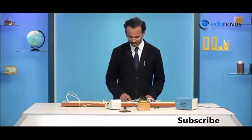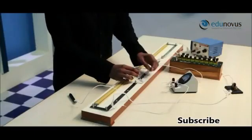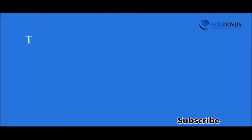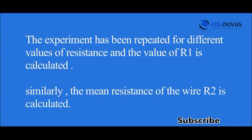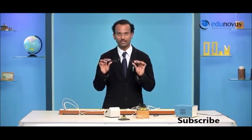Similarly, you can find the mean resistance of the second wire R2 by replacing R1 with R2 in the right gap of the meter bridge. When we connect the two wires end to end, they are connected in series. To find the effective resistance of this series combination, connect it to the right gap of the meter bridge and follow the same procedure used to find the unknown resistance for a single wire.